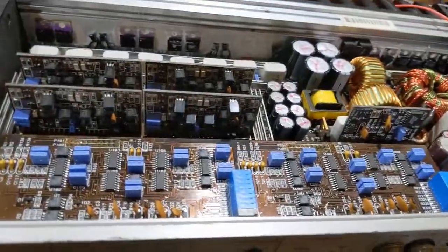Resistors are in. Time to put the transistor back in and put it back in the board and try it again. The board is now back in place, got the wires in, got the power supply on. This time for a second attempt on camera because I honestly do not know what's going to happen. There we go — now we've got all four lights. Current's climbing a little bit — should settle, but it's probably going to get hot because there's no heat sink. Now they're getting warm.